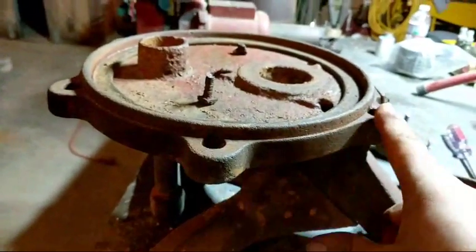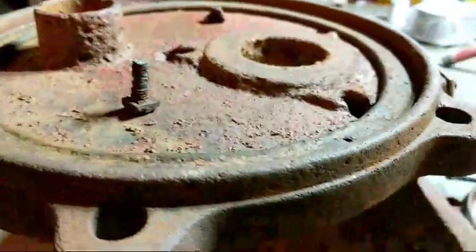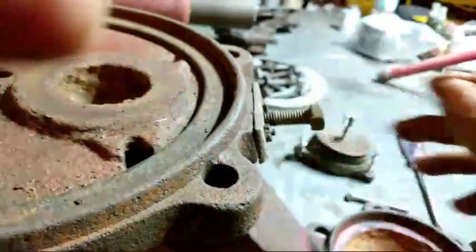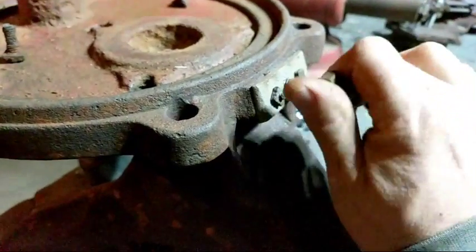And again, I've broken every one of these bolts with a badly adjusted ram by not having the snifter correctly adjusted. So again, back to the snifter. This is kind of the key to ram pump operation, making it sustainable, making it run forever.